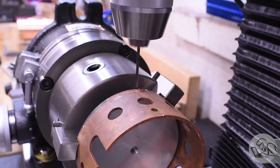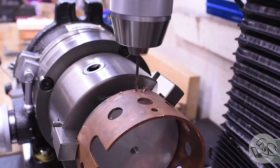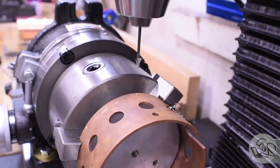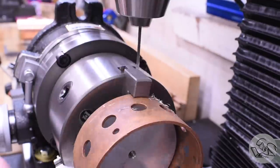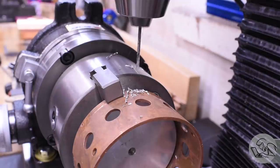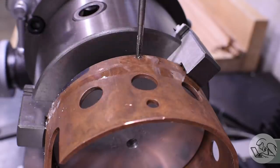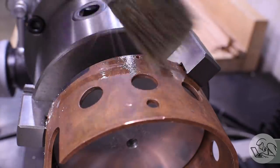The band is going to have 12 holes, but they're offset because the band is not wide enough for the holes to be in line. I didn't want to make the band too wide, so my thought was I'll stagger them so that I can have a skinnier band and still have six bolts on each piece holding it. After spotting, I drilled each one through to tapping size — drilling straight into that buck, which is sacrificial and I need clearance below the work for the tap. It's a reasonable question whether it's a good idea to tap directly into the copper, but this piece is never going to be removed and installed repeatedly — it's going to be installed once and left that way for life. I have enough thickness here for this fine thread that I actually have four and a half threads in those holes.